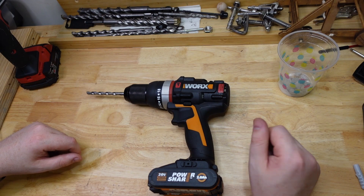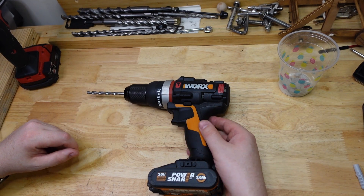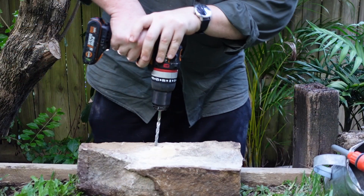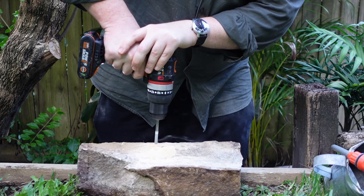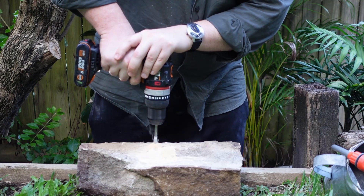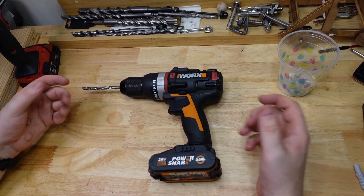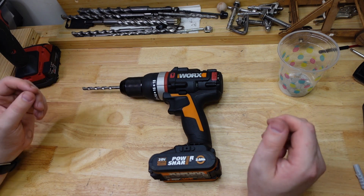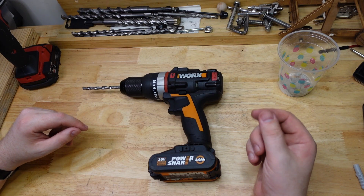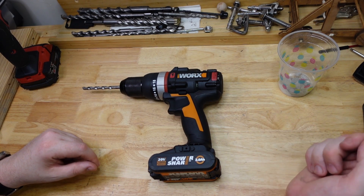It might help if you try a few different spots. Maybe persevere, maybe bring a bit of water. If you've got some really hard aggregate where you are — why don't we try a bit of sandstone? Wow, okay. So this local sandstone we have around Southeast Queensland is usually really soft, and that was nothing for this drill. It seemed to just pulverize, turned into a powder, gum up the drill bit a little bit there. But anyway, she handled that just great.